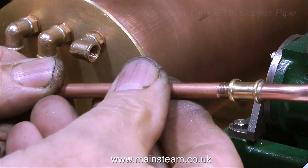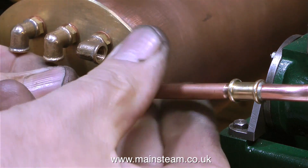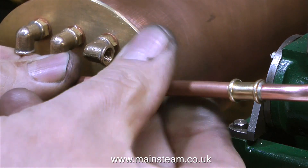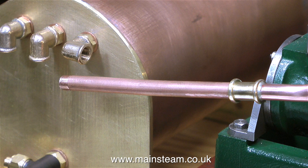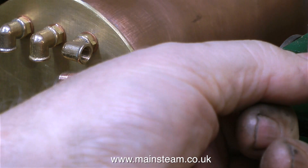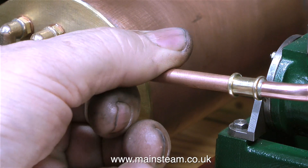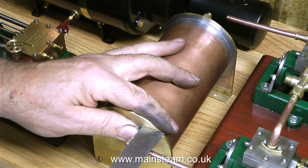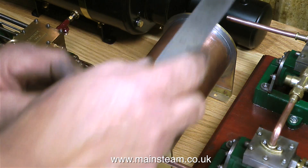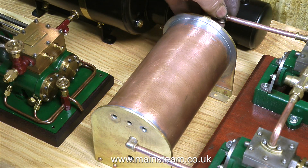I'm going to make two of these identical pieces of threaded copper tubing, one for each side. Steam engines are gas engines — steam is an invisible gas; the stuff that you see coming out of the chimney is really water vapor. This invisible gas needs to get on its way, do its job, and come out without going round too many corners. For that reason, I've decided that the exhaust from each of the cylinders will go into each side of the condenser.